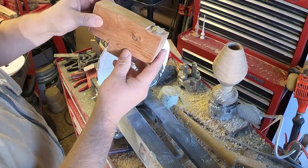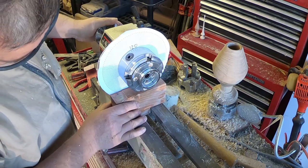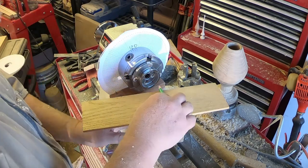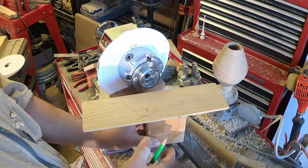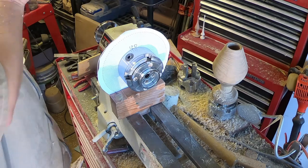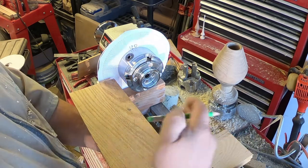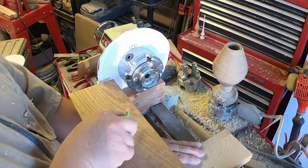I have this high-tech block of 2x4 with a nail and some hot glue. It fits into the hole to hold everything in place. I use my little pedestal here, which is dead on center, and I can drag that right across the plate. Now, if I happen to have a vessel or some such other thing that's not a plate, I have this — I generally clamp it down on the back side of the lathe ways, and it'll allow me to go right alongside the vessel or vase or whatever I may have.